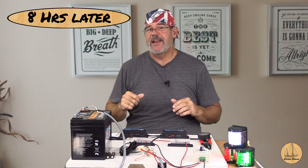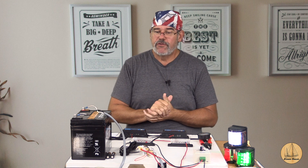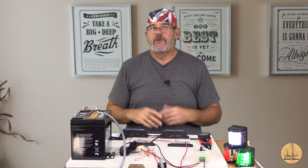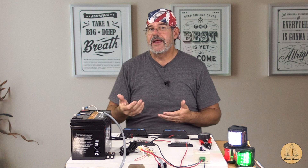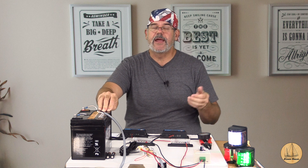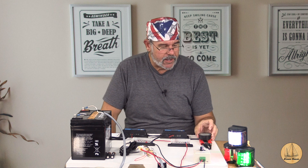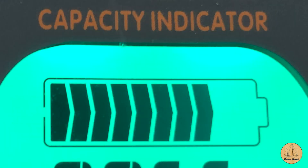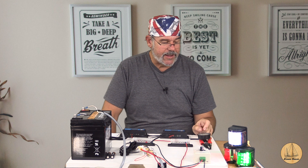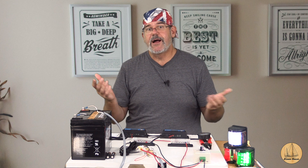It's now about seven and a half to eight hours later. We were filming around 8 a.m. and it is now 4:50 p.m. If we were drawing 0.9-something amps — rounding to one amp — for about eight hours, we would have drained eight amp hours out of our 35 amp hour battery, putting us at about 27 amp hours remaining. I click on the device and it shows roughly three-quarters on the fuel-cell indicator. Clicking the amp hour button, I can see exactly: I'm at 27.49 amp hours. That's right on — it seems to make sense.